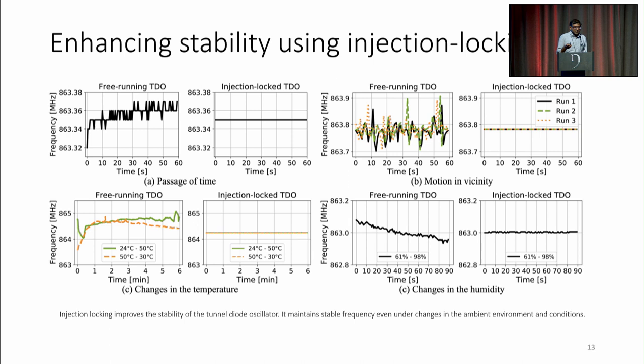Now the second problem is that when you mix a digital baseband signal in a tunnel diode oscillator, it creates a lot of harmonics. This is not great. First of all, these things are sensitive, so if you put two of these anywhere near each other they'll interfere, but it's also not good for FCC spectral masking considerations. What's really going on is that the oscillator is acting as what's called a self-oscillating mixer — it actually oscillates and mixes, and it creates these harmonics. Now we can get rid of these harmonics, as it turns out.